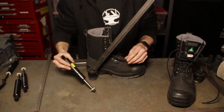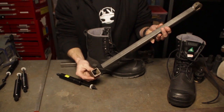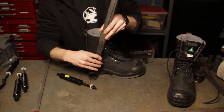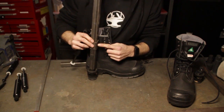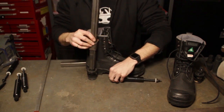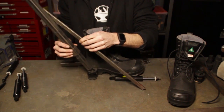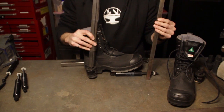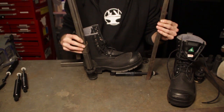So I think this will be really important in being able to get back up again after picking up a heavy weight. What we're going to do is we've taken a piece of box tube that's slightly larger, and it fits over top of this tube. Then we're going to make a welded gusset on here to mount this. To do that, I'm going to use some of this quarter-inch thick cold rolled steel — we're just going to weld that on there, drill a hole through, and put in a rather beefy cotter pin. So let's try building it.